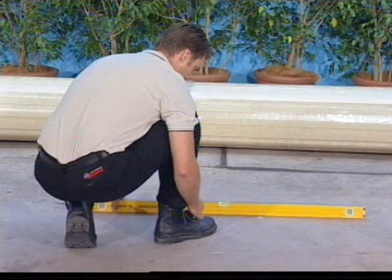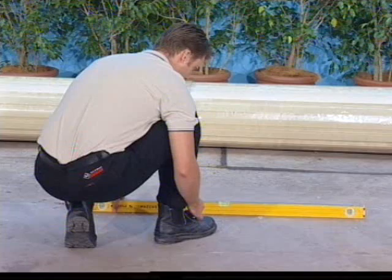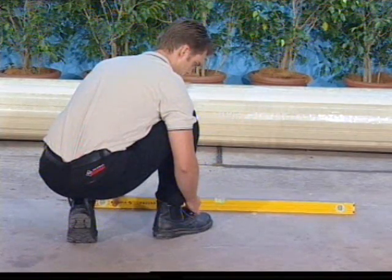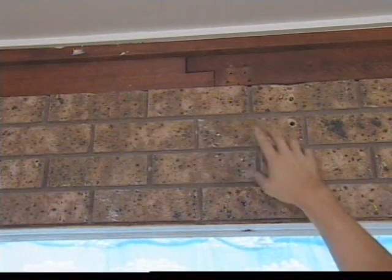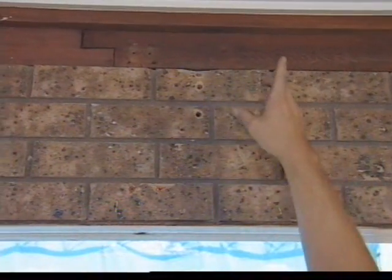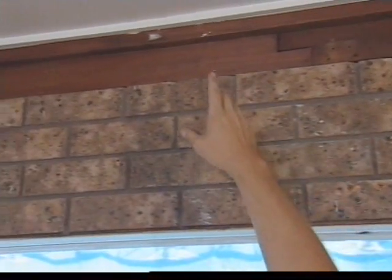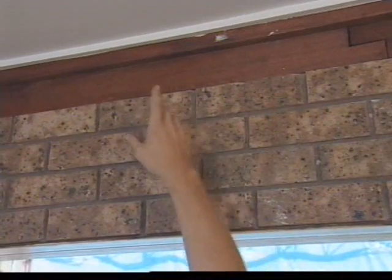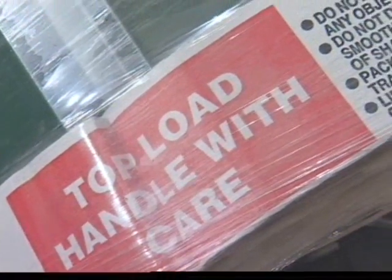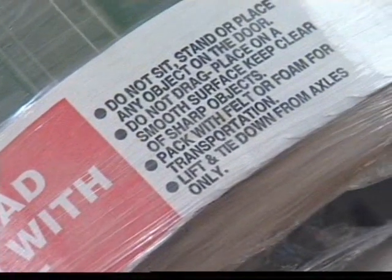The floor should be level or recessed across the opening to avoid gaps. If the floor is not level, contact B&D for taper panel options. Ensure the opening is strong enough to support the door. Ensure that the surface where the door will be fitted is flush and smooth and the area behind the opening is free from any protrusions. Do not unwrap the door roll at this stage.